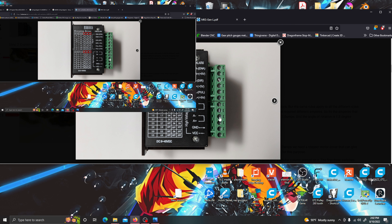I know I already learned how to connect the wires for the stepper motors — this is A and B. So two wires are one coil and two wires are another coil, which is A and B. This goes to the power supply, which can take 12 or 24 volts. I'm using 24 volts.